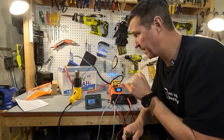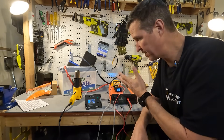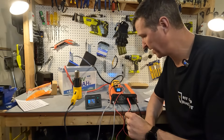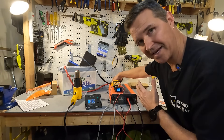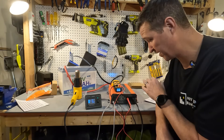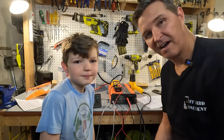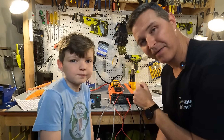Next we're going to put about a 100-amp load on, which will give it about 1200 watts. We'll watch for voltage drop and let it run for about five minutes to make sure nothing weird happens. Our voltage is at 119.9 — almost exactly 120 volts. Turning the load on high, the fans on the back turn on automatically, and our voltage has actually gone up to 120 volts. The monitor shows we're using about 1164 watts. After five minutes, the inverter had no issues whatsoever powering this 1100-watt load.